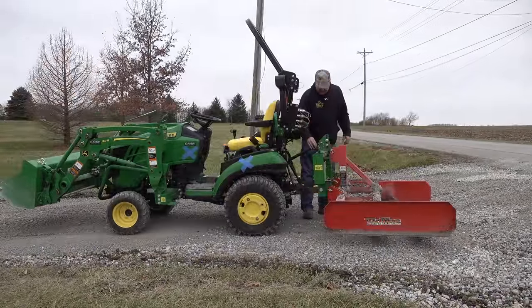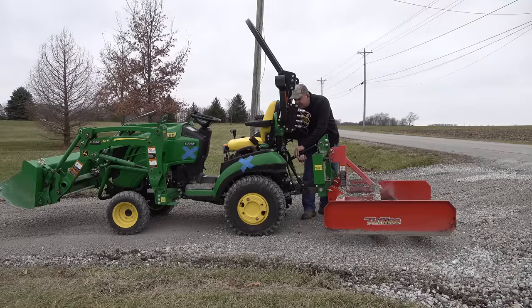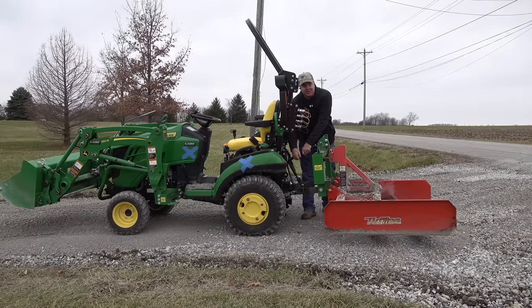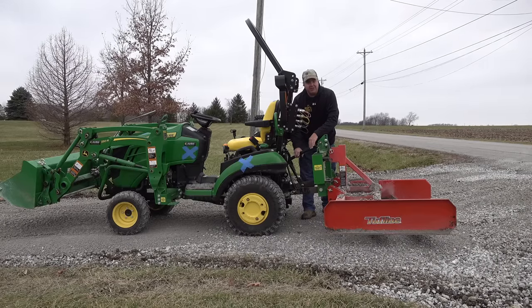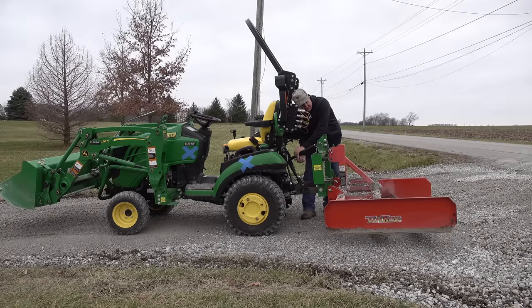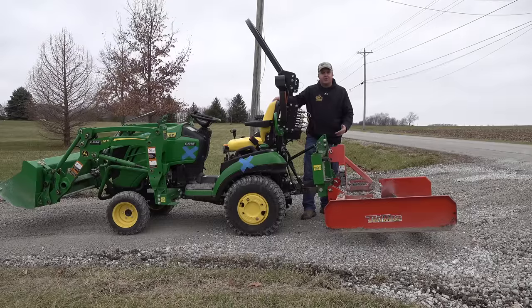I'm going to make an adjustment here for the last pass. I'm going to shorten the top link a little bit to get that back cutter raised just a little bit. I don't want it cutting on this last pass — I would prefer to have the front cutter doing most of the cutting and the back one just do a little bit of leveling. What I found today is that the chunks that come off are wet and they're leaving little piles, and those little piles are actually going to turn into chuck holes if I don't watch it. So I want the back to be up high enough to allow some rock to go under it and smooth a little bit better. You can use a device like this however you want — don't follow any rules. Use it in a way that works for you for this particular time and application. Nobody's grading or keeping score.